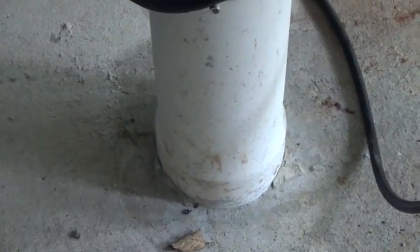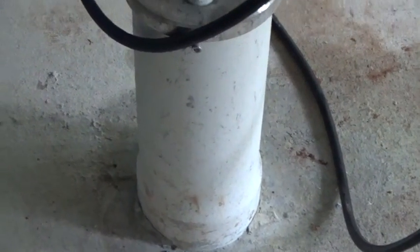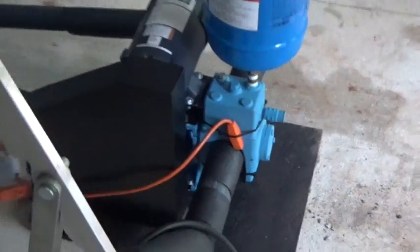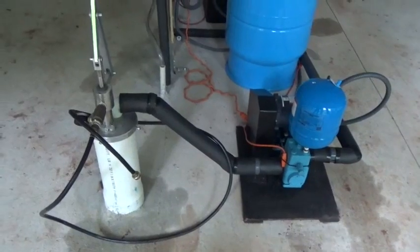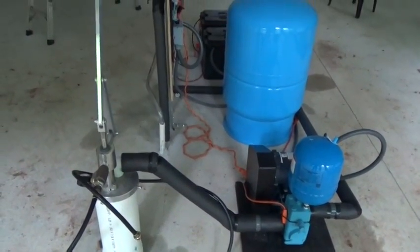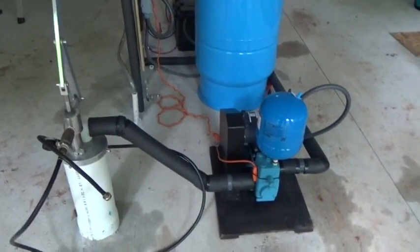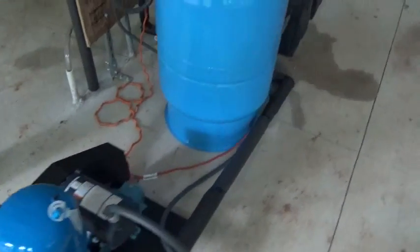They have a really good well producing a ton of water. Also put the Simple Pump on it. My static water level here is at 11 feet, so it's really just an awesome setup. A great recovery rate and high static level allows you to do things like put in a booster pump that pulls water from your well and boosts it up to 50-60 PSI, giving you nine gallons a minute.